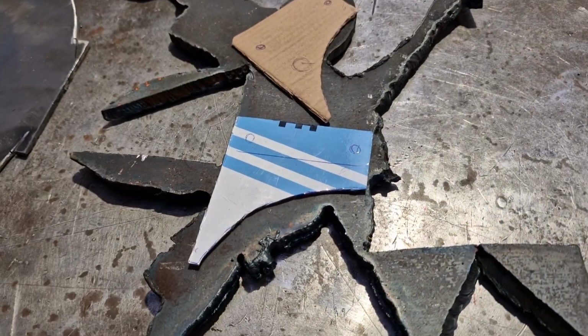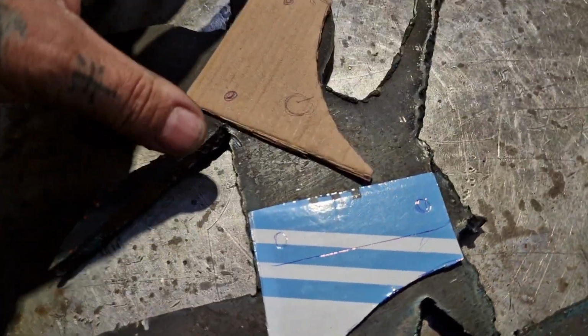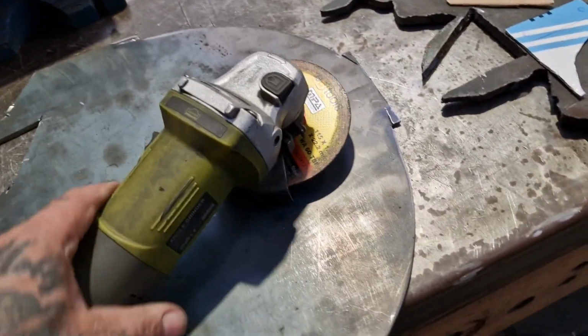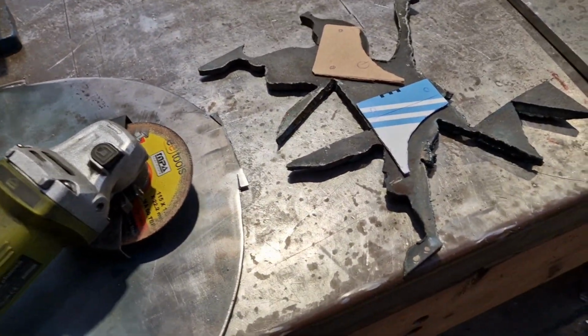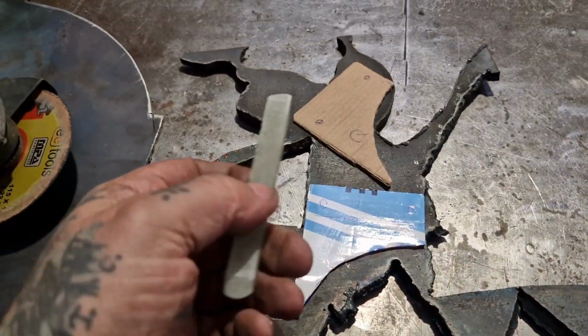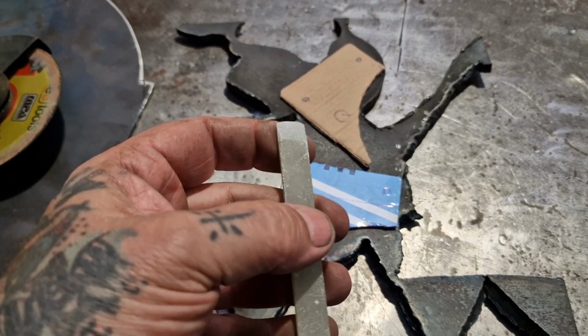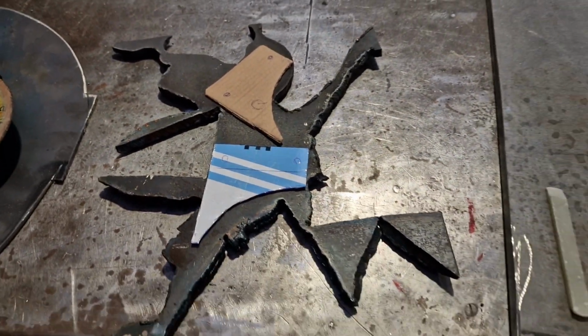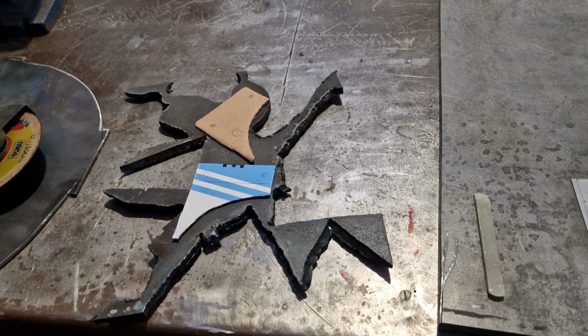I think I'm going to have to scratch them out of this. Just squeeze them out, and they just about fit. So that'll be plenty of grinder action to trim those out, which I'll spare you. Basically, I'll draw around them with the old soapstone chalk and get them cut out. And then I'll tack them together and clean them up accordingly, I think.